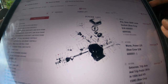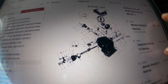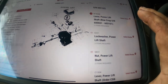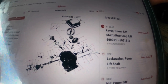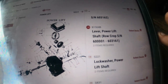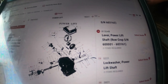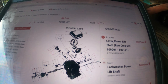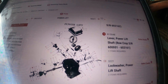When you look at the parts book for the 60, power lift is number 18. Scrolling down to number 18, it says: lever, power lift, B-1504B. The prefix B means that it should fit the 70. Like I talked about in the video with the pulleys — whatever the part was used on first got assigned a part number tied to that model. So in this case, B meant it was for the 70.